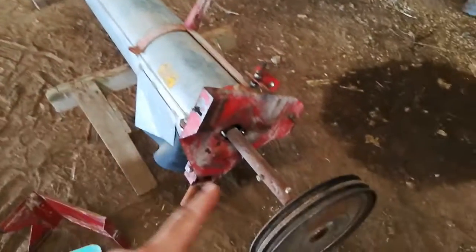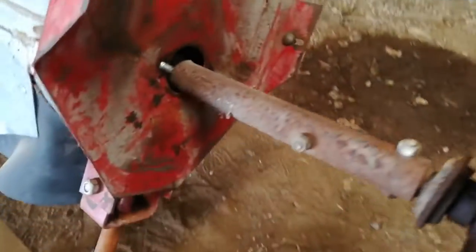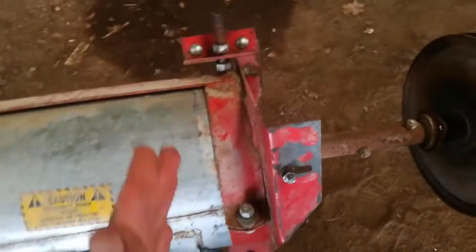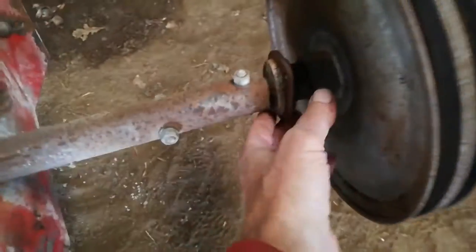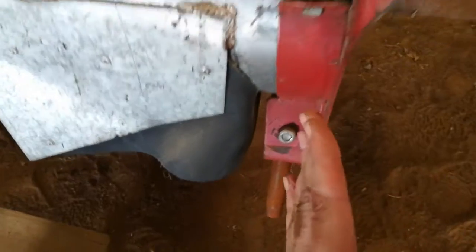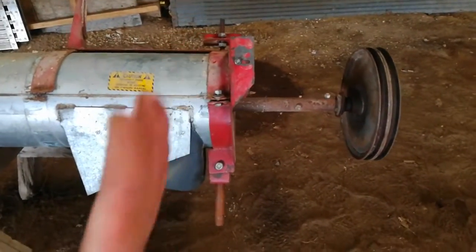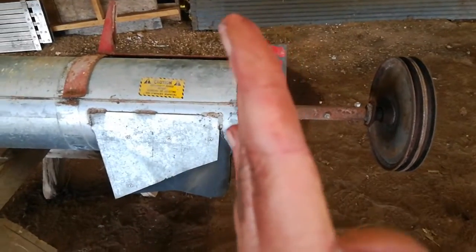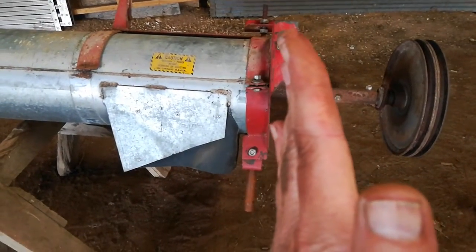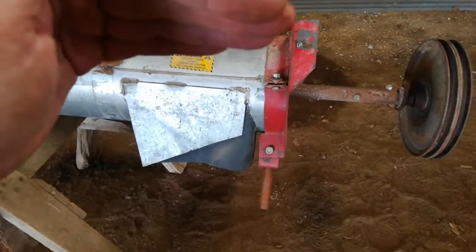The tube isn't bent. The auger has got to be buggered up somehow, and I think a big part of it is this plate here. This face plate that the bearing is in was kicked out at the bottom. It's kind of cockeyed now, so now you're looking straight at the side. I'm exaggerating with my hand, but it should be 90 degrees.